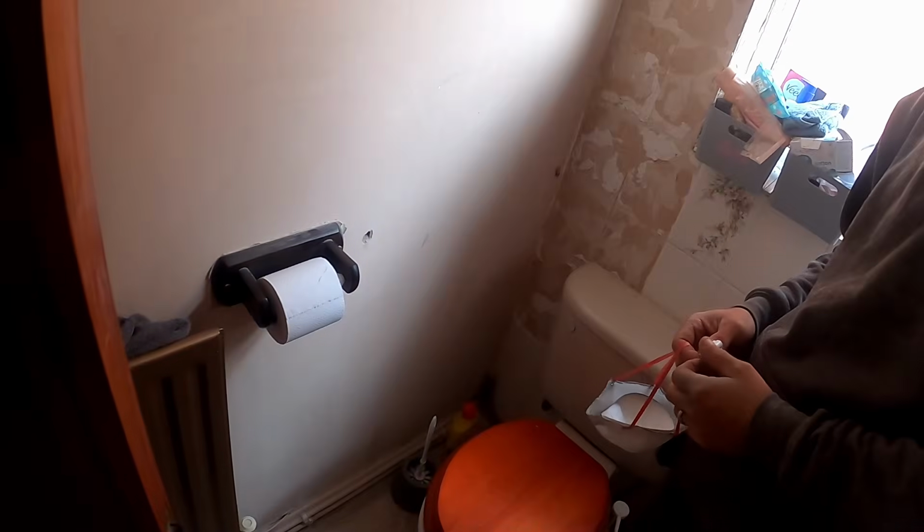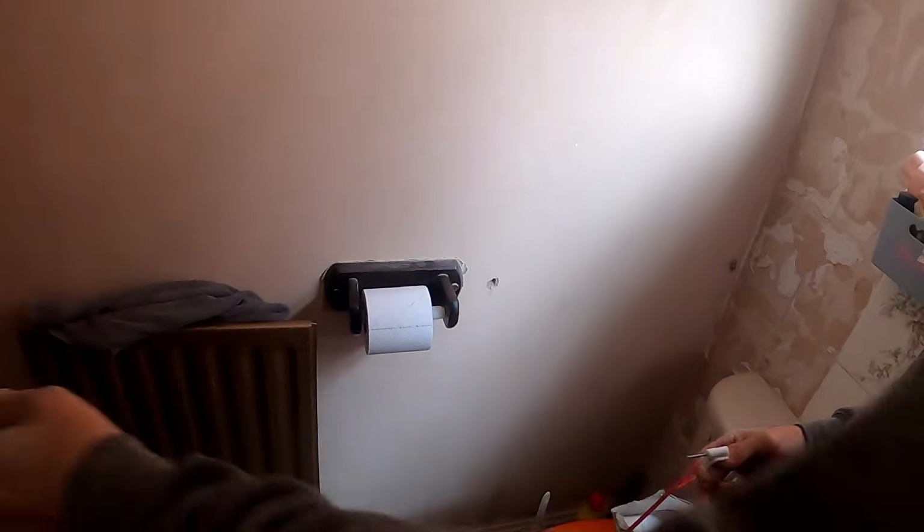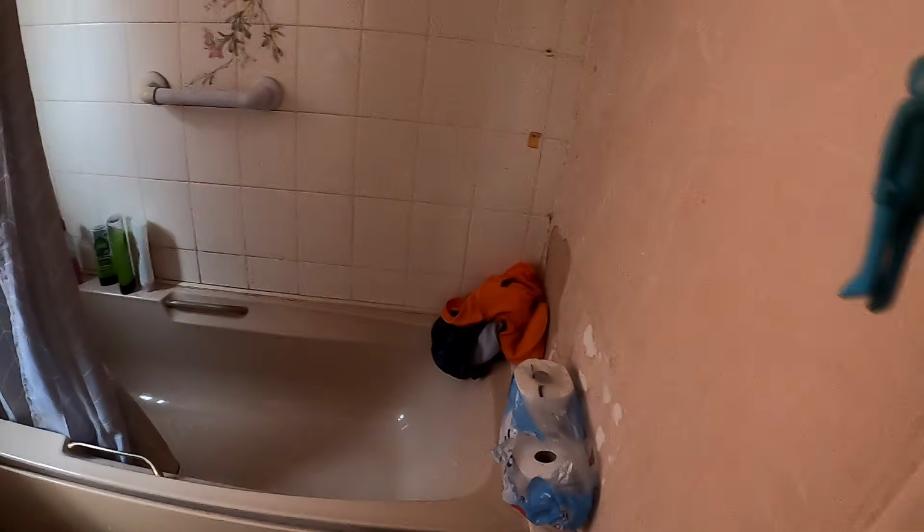Well, that cylinder's going to have to come out, innit? We're gonna have to leave the bathroom in for a bit, and then we'll get the shower room done, because then we can get it all on the combi, and this will all be on the combi side. I'll just pick up the existing hot and colds. The point at which you tie the gas in, yeah.